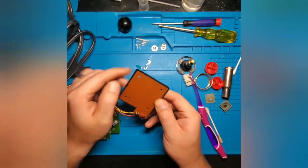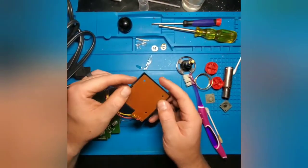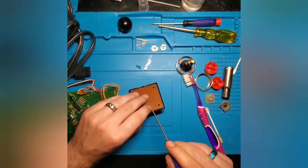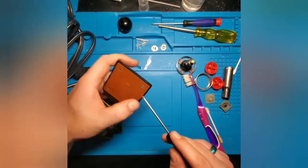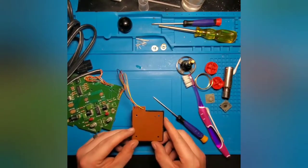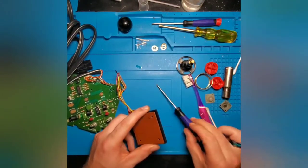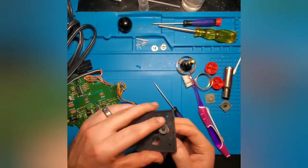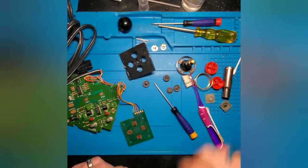To get into the circuit board itself to clean the contacts, you need to very gently bend these two tabs back so you can get the main board out. I like to use a small flathead screwdriver for a little leverage. I noticed this clip sits on top of the board more than the other, so I put the flathead screwdriver underneath the board, gently lifted it, and it came right up. Underneath you have rubber contacts — we'll take those off and give them a good cleaning, but first we'll clean the board.